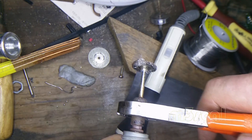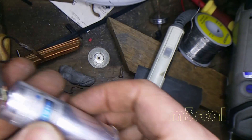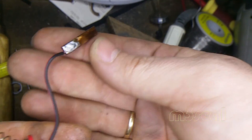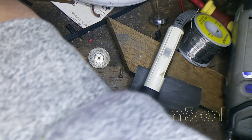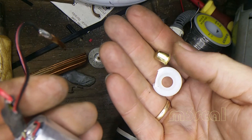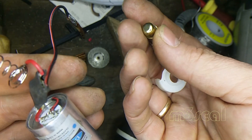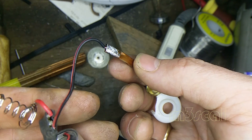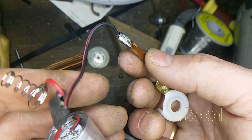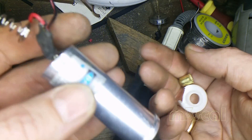So I've got everything set up quite nicely. I've put a spring in that and I've got this little piece robbed out of another torch — that other failed torch where I got that extra aluminium barrel. This completes the circuit with the top end of an 18650, and then the negative is going to go to the barrel which connects to the barrel and the switch anyway, so this will all work quite nicely.